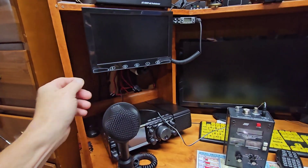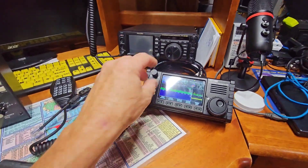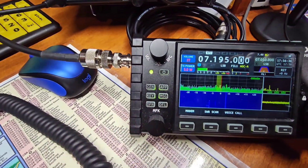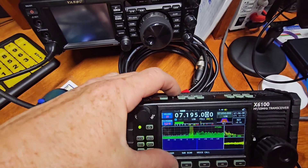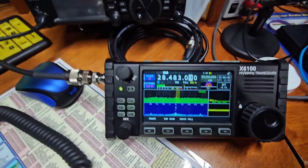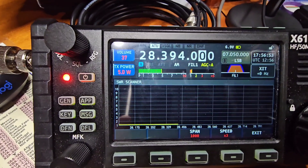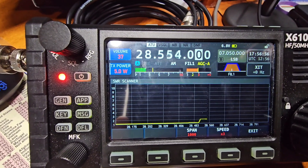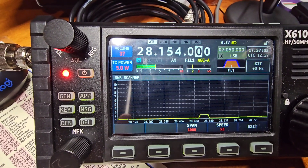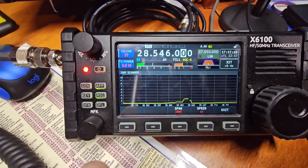Back down in the shack. I did a little remodeling and hooked things up above, and did some configuration here, but I'm still not done yet. We know it didn't tune good on 40 and it's not going to tune good on 40 — so let me go back down to 10 meters and hit the scan again and see how grounding affected it. You can see it's going pretty well — we still got that little hump there, but it did not change the SWRs on 10 meters. That goes to about 28.701 MHz.